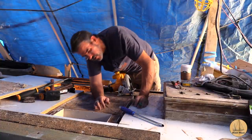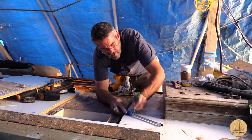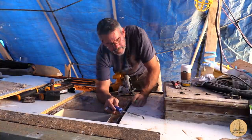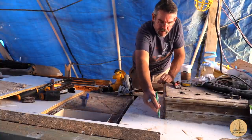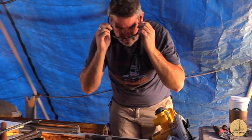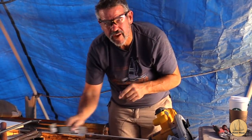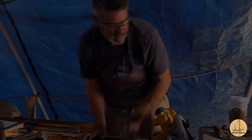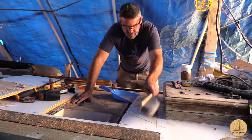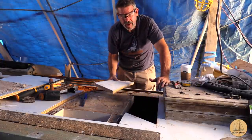This is the head wall and it goes at about that angle right there. I'm going to cut right along that same line because that's a good solid place to put the new piece of wood. There's also a beam that runs right about here so I'll cut along that. Yesterday I was getting sawdust chips in my face and don't want to repeat that - with all the open compartments down into the engine room I'm just trying to keep things a little bit neat with the sawdust.